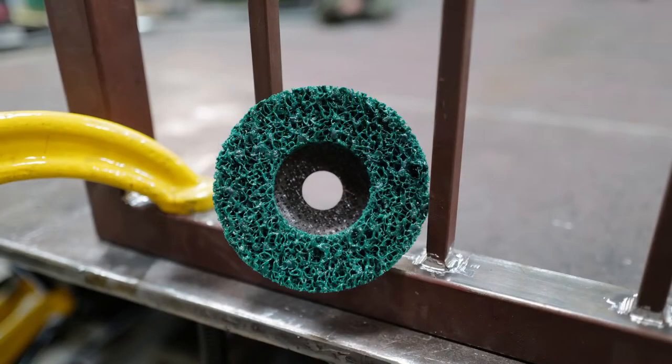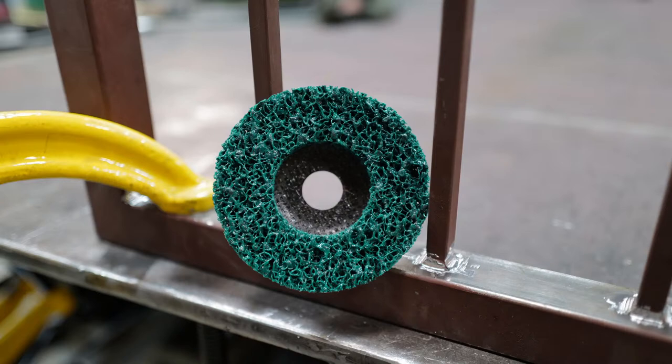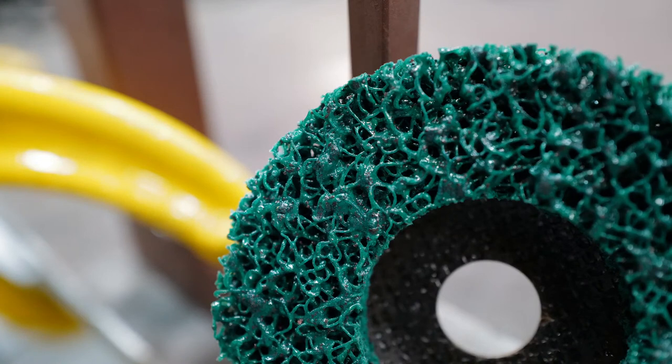Both of these are used to clean up. First we're going to talk about the NCD 200 HD. So Landon, tell us about this new product. It's another power wheel and the HD stands for heavy duty, referring to the density of the wheel itself — the fiber is a little more firm and put together. The biggest difference compared to the standard is the top of grain: it has a ceramic coated aluminum oxide, giving you a more durable grain and more durable fibers. That's why we call it heavy duty — you'll see how effortlessly it removes paint and rust, with more aggression in general.